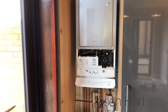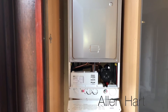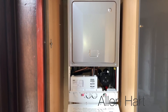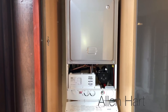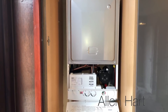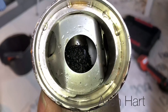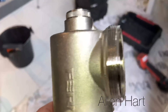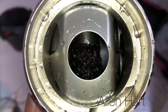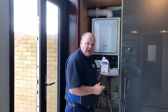So we've got the new boiler on the wall now. We did a mains flush before we started. We're now going to connect the MagnaCleanse onto this and do a flush — we're going to put some F3 chemicals in, and then after we finish we'll put some inhibitor in as well. This system did have a Spirotech on, so I've just put this Fernox Omega on for a few seconds and it's already got muck in there.